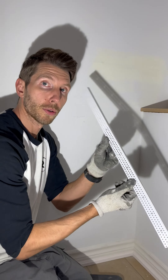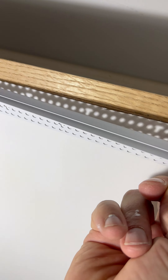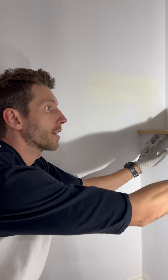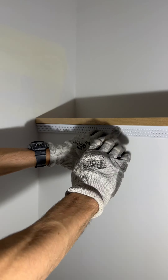I'll show you how it works and why it's so good. This is a T-shape. You slide the back lip inside the gap and then push the bead all the way up. That's the concept. And then when I mud this, there's actually a lip on this trim that prevents the mud from getting on a surface you don't want it. And then when you're done, this lip tears right off and you're left with nothing but a smooth surface where the drywall meets the oak.